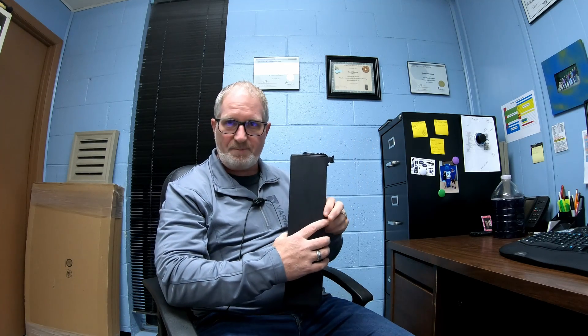Flash can happen on the parting line, and it can actually happen on the slides, cams, or lifters — whatever everybody calls them. So it can happen in different areas. Let's say you go up to a press and you've been running that press all day long, and then the operator calls you and says flash — what would be the first thing you'd probably want to look at?